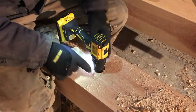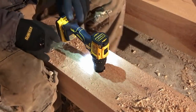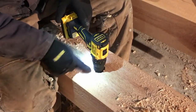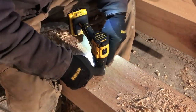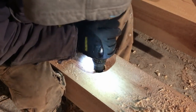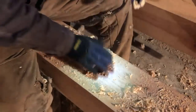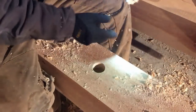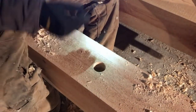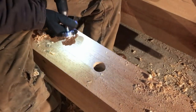Now when you go in, the way as deep as these pockets are, I have to bury the chuck just a little bit, not very far, but that's a really good way to see that you're the same. I've got about 3/16 of an inch all the way around this, and that's perfect. That means I went down this nice and square. Now the two ends of the mortise, that's where it's really important to go down nice and square.